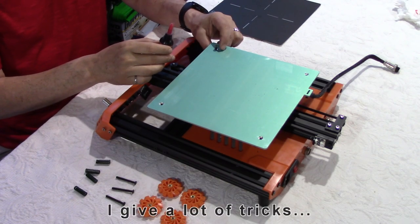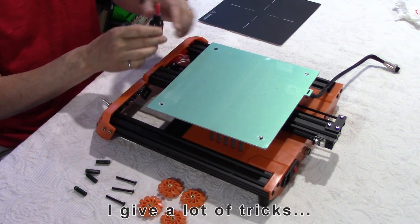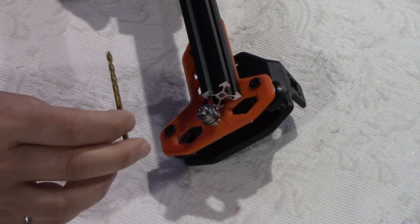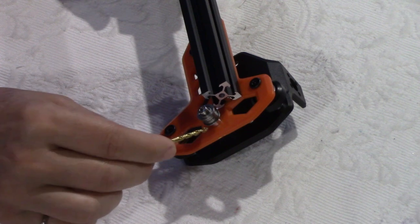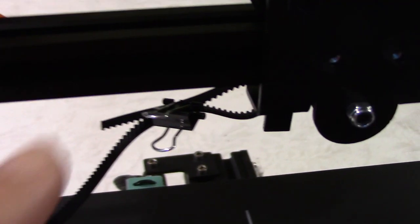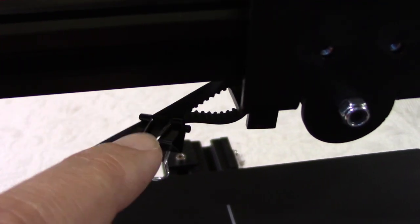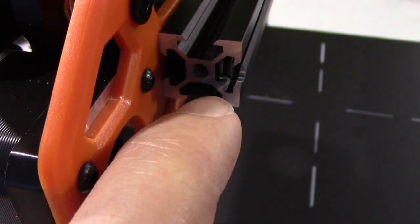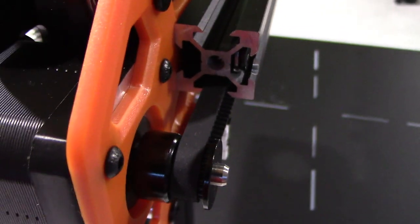I used Loctite here under the screw to lock it in place in the hotbed. I used a drill bit as you can see here and I just tapped the top of the hole to make it a bit larger, using the clip again technique so that I can easily put the two tie wraps. This is like using a third hand. We need to adjust this so that the belt is right in the center of the rail.